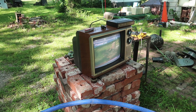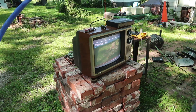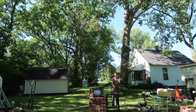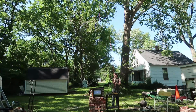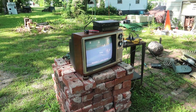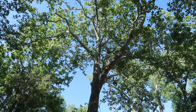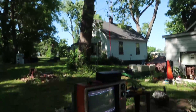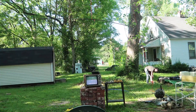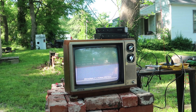I went down to 12 feet and that's still not working. I think perhaps this television just really wants to have a dipole. So what I'm going to do is suspend this and then have one wire running on each side down to this transformer like it should be. I tried this in two different boxes with and without the transformer and it's just not getting any signal. Oh wait — I'm an idiot. This is like a double wave antenna. The dipole has to be half the length — each one has to be half as long. Well, we've got three channels — same channels, and they're upper frequency ones too. That's strange. Channel 55.